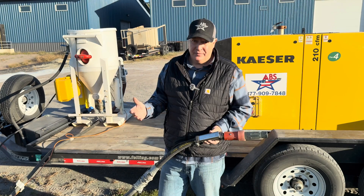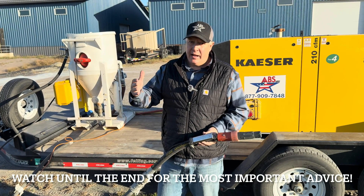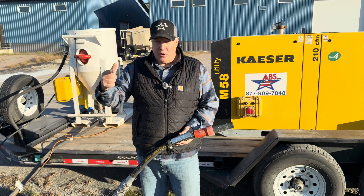This is Jason Johnson with ABS Supply — now it's your turn to go have a blast. Hopefully this is helpful. If you have any questions on setting up our rental trailer or your own, give us a call at ABS Supply. Don't worry about blowing things up — it's not that big a deal. All you got to remember: air in, air out. The two ball valves on the pot are the most important. To start blasting: first close the exhaust valve, second open the air inlet valve. When you need to refill, opposite order: first close the air inlet valve to the pot, then open the exhaust valve. You'll be just fine — you got this.